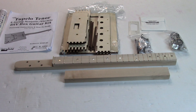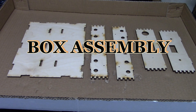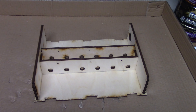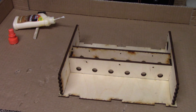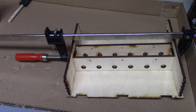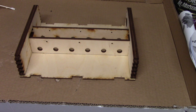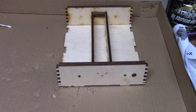The box was assembled: the parts were first dry fitted, then glued with wood glue and clamped overnight. The internal braces were glued to the bottom. The tailpiece and the box front were glued into place. Front, back, exterior, and panels were glued in place, and then four half-inch screws were installed.